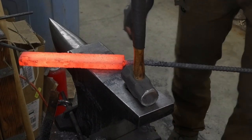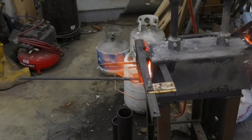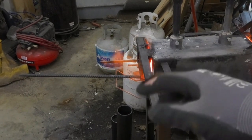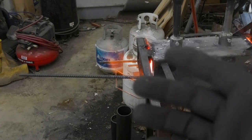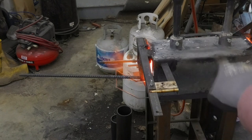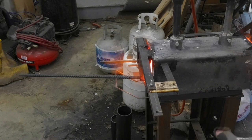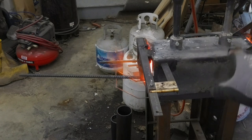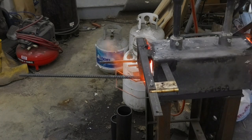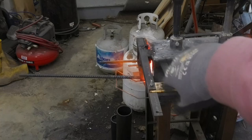I could try adjusting the burners so there's less oxygen in here. You see a lot more of the yellow flame coming out — that means the fire is a little bit deprived of oxygen, which means there's no oxygen in the middle of the forge. That's going to help the weld because there's no oxygen in there, and it's also going to result in less scale and less waste from the surface being oxidized. So I want a bunch of that yellow flame coming out.